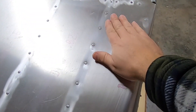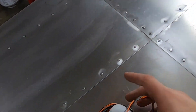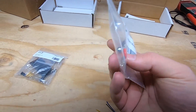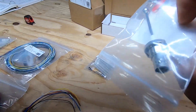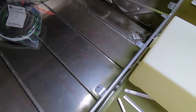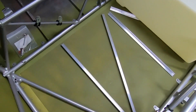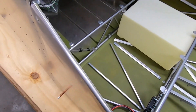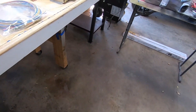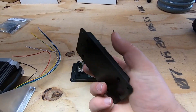I'm choosing back here for mine, since I'll have the COM and ELT whip antennas up in the two corners where I put the doublers. I'll get to mounting the GPS antenna real soon. Here's the transponder antenna — both it and the ADS-B receiver antenna are very similar looking, and I plan to locate these after the header tank on either side. It's a good idea to have these spaced out sufficiently to not have any issues with reception or transmit later. Do your homework before drilling the holes in your new airplane. I'm open to hearing your concerns or other ideas, so let me know in the comments what you would do.